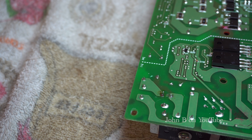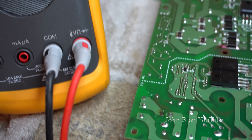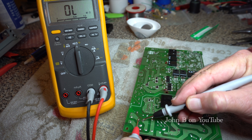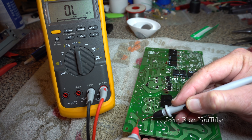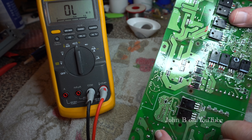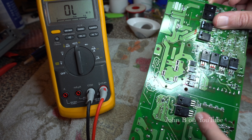So let's measure it — I think it said 6.8 ohms. I'll zoom out so you can see the meter. So the first time testing this resistor. We're looking for 6.8 ohms. Open circuit. Touch the leads — 0.1. Open circuit. So someone has probably checked it and either not replaced it, or it looks like it has been replaced — because that is fresh flux on there. So they've probably changed that and it's blown again because these FETs were short circuit.